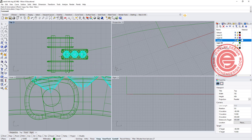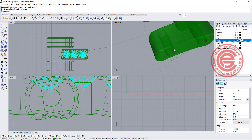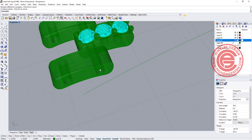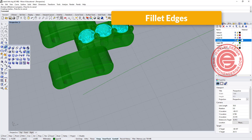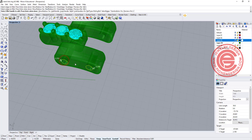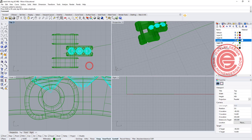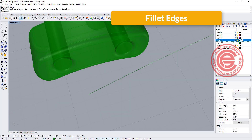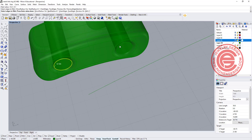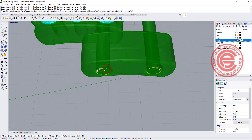For those pins, I'm going to make a copy first and hide one of them, then use boolean difference — differencing the pins out from the link body on each side. Looking at the perspective view, I now have the pin holes. I'll apply fillet edges for better rendering. Coming over here and doing fillet edges as well, then bring the pin back. For the visible pins I want them a little bit shorter for rendering purposes, and I'll fillet those edges too at 0.1 millimeters. This just looks better for rendering — as you can see in the render view, it feels like two different materials.